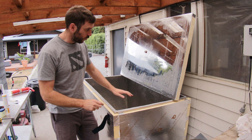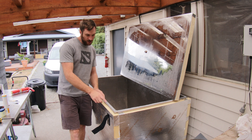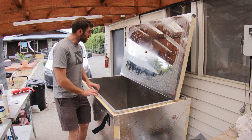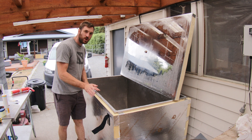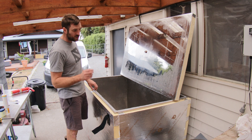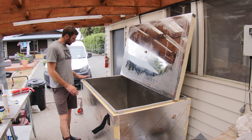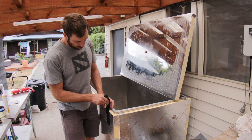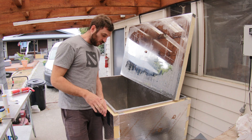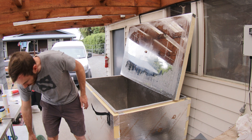I left it for two days to form this silicon seal and it worked pretty well. Unfortunately the silicon in the very middle of the strip wasn't curing — I think because it had not much access to the atmosphere around it. When we pulled the top off it actually pulled off a wee thin strip along the middle, but there's still quite a good silicon gasket here. I tested it last night and heated up to about 92 degrees centigrade — it was fairly well sealed. There was a little bit of steam coming out of one corner but as soon as we put a bit of weight on it that stopped. Velcro doesn't put enough downforce, so putting 10 kilo weights on the corner works better.